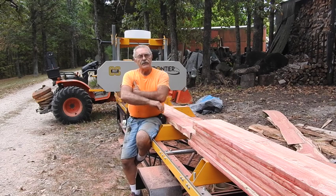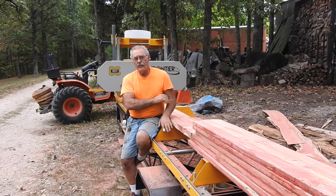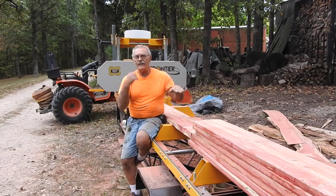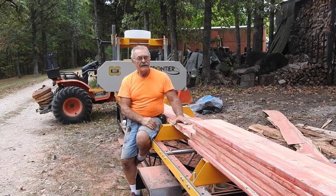That's my own thought. Another thought too: on a circular mill, we always saw from the big end, from the butt cut, but I can see the benefits on this one of sawing from the small end, because you're more accurate in estimating the height of the first cut for the slab, instead of having to measure up from the knee or from the bunk and then set your scale at that number. You've got it right up there on that end. You can eyeball it, set it, and go. That's my own 2 cents worth. My dad's probably rolling over in his grave hearing me say that, because he always insisted on cutting from the butt end first on the old circular mills. But I think nowadays it's just going to be whatever works out easiest.